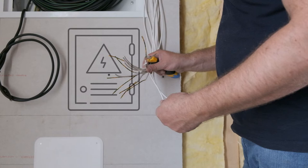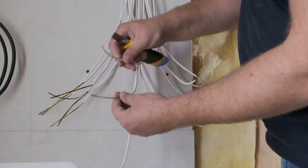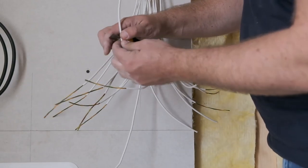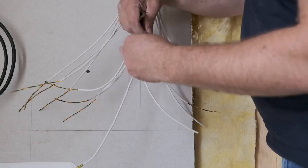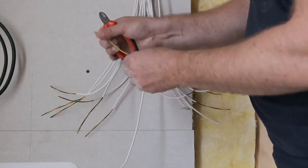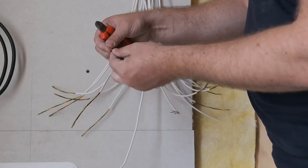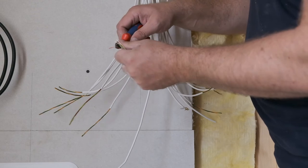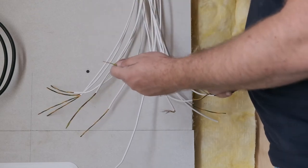Lead all the cables from the sensors to the location where the given switchboard and, subsequently, central unit will be installed. The switchboard is not usually installed yet when the sensors are being installed. Shorten the cables to an identical length as needed. Carefully remove the external insulation from their ends and from individual wires along a segment of approximately half a centimeter.